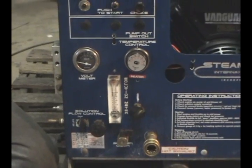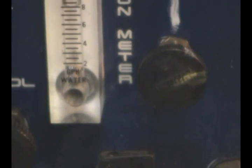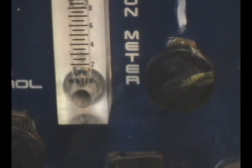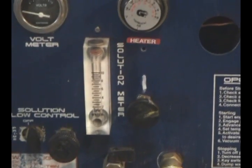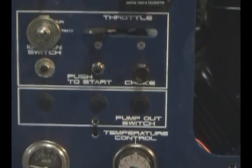Or if you're really demanding heat on a cold winter's day, or if you have some tough spots in the house, you can turn the orifice all the way to super heat and go from there. It doesn't recycle any preheated water from the exhaust heat exchanger back through the system. It relies completely on the 300 to 400 degree temperature of the crankcase and the air-cooled engine, or heat from the blower.